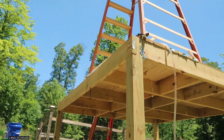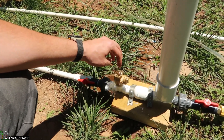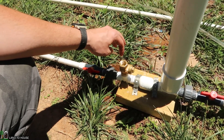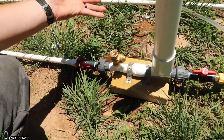You'll notice that I now have water coming out of the delivery pipe. What you're going to see is that back pressure is never built, so this is just going to continue to push water out the top — basically faster than the pressure can build in the tank — and it's just never going to start on its own.